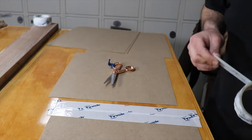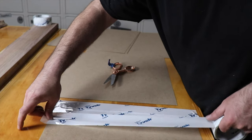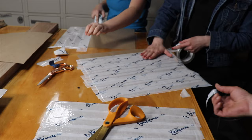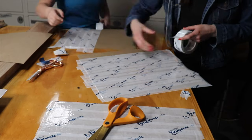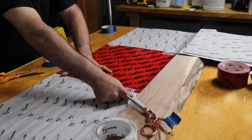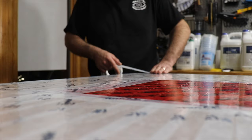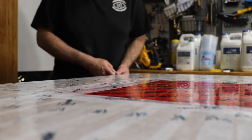The dimensions of my mold were coincidentally almost identical to the dimensions of our tabletops, so I decided to just turn the tabletop itself into the base of the mold. Seemed like the easiest option. So with some helping hands, I coated a bunch of chipboard with Tyvek tape and then pieced those together and thoroughly taped it down to completely cover and protect the tabletop.